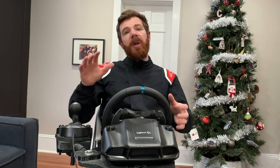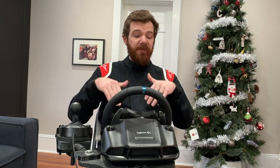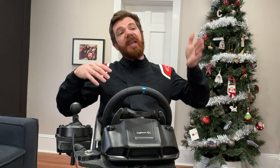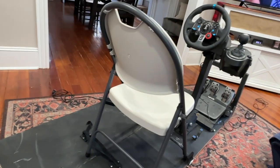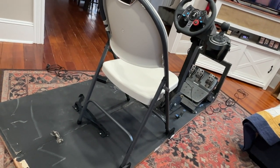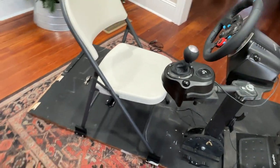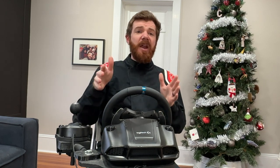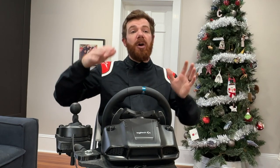To build the cabinet, I took my wheel assembly and pedal assembly and placed them on a half-inch sheet of plywood. It ended up being 16 inches wide for the foot panel — that's the face panel which holds the wheel and everything together — and 17 inches wide for the side panel, all by about 6 feet (72 inches) long. I used my basic measurements from ImageJ to get the pedal position, and I wasn't too worried because I made everything so adjustable. I fixed everything down using a series of glue and screws. An important step was designing a base frame made using 1x1 pine, which acts as both a footrest for the pedals and what it stands on when in storage mode.